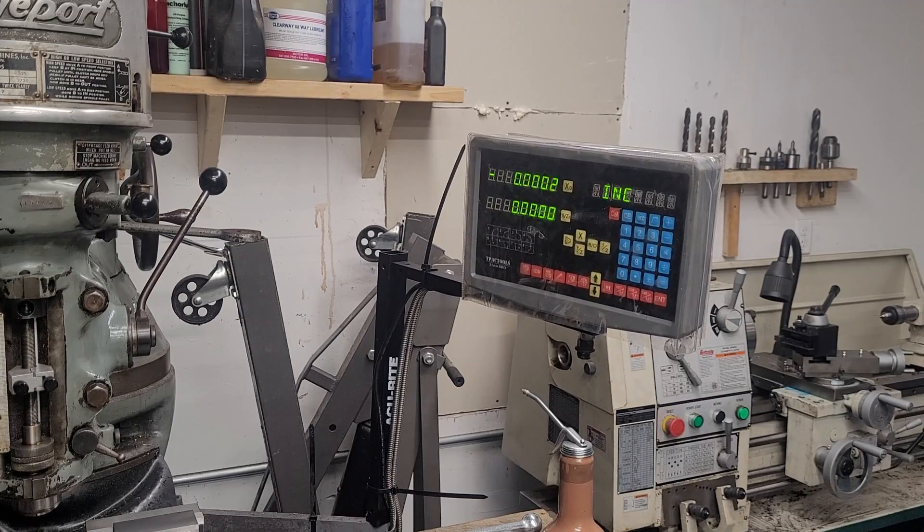Okay, so you can read it. We're going to look at the Y axis — watch the Y. I just locked the Gib. I unlocked the Gib. Locked the Gib. Unlocked the Gib. Locking and unlocking, depending on your axes — my X axis, some of the time I don't get any movement. I can usually count on about two-tenths of movement, sometimes four, from locking and unlocking my Gibbs.